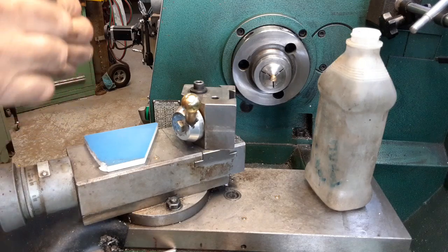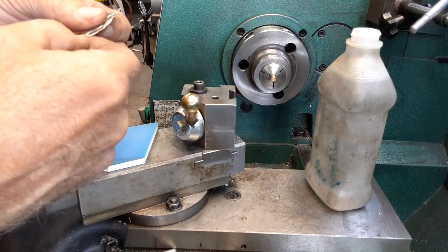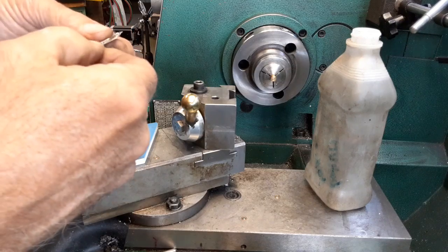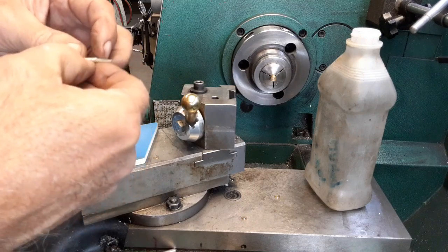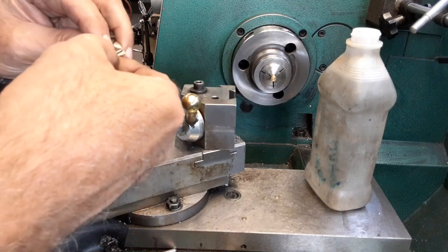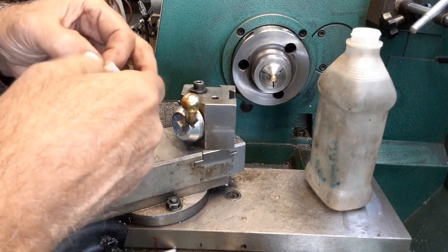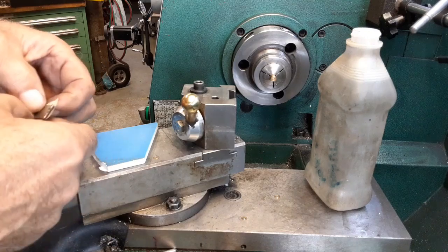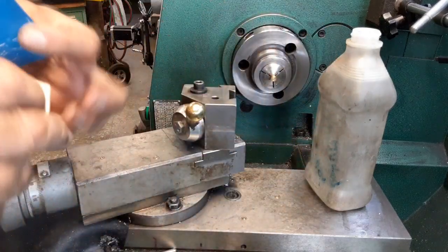But I know I could take and, making these gears is going to probably turn out to be two or three videos, because there's a lot of operations on making a bevel gear. I'm making a fairly easy one, 18 tooth, there's 18 teeth on it, and 48 is what the tooth pitch is going to be, so on in this corner.